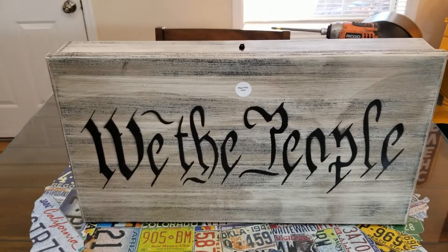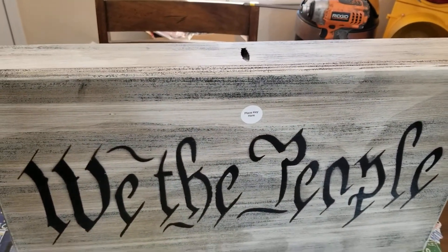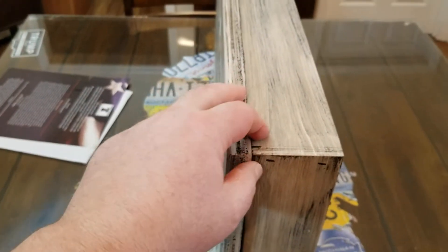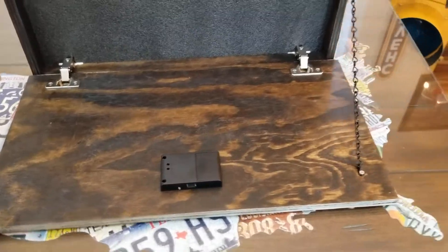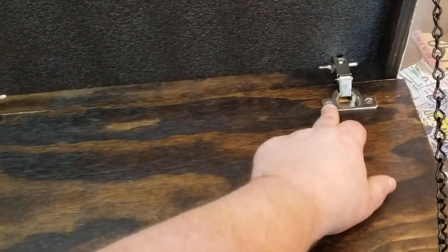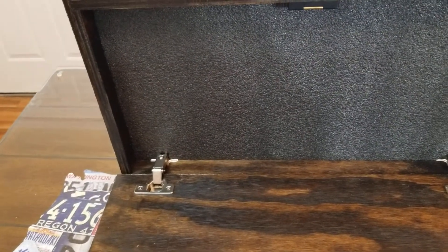For 150 bucks you can't go wrong, and it looks really sharp. It is made out of plywood, but they've done a really good job on the fit and finish - everything is nicely put together. The lid is magnetic, so it'll shut itself closed. The lid itself is three-quarter inch plywood, nicely stained, with high-end style cabinet hinges. There's also foam inside that you can cut out to custom-fit your guns so they hold in place.